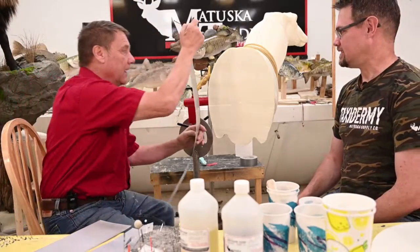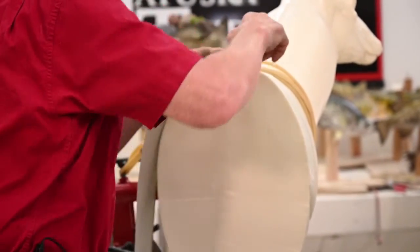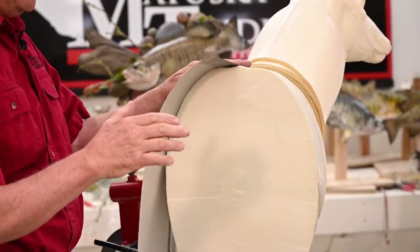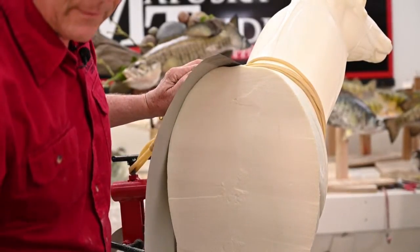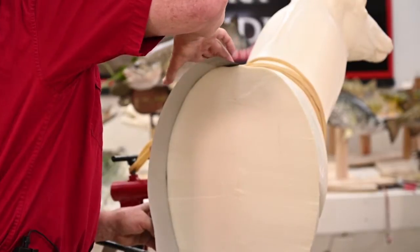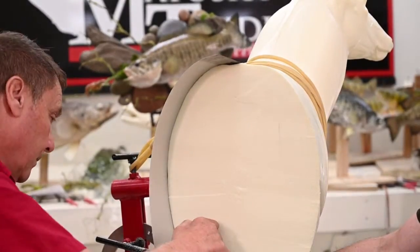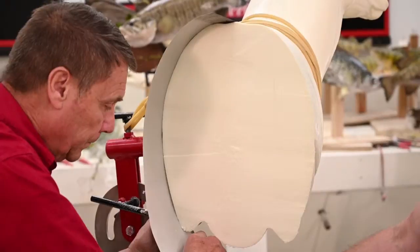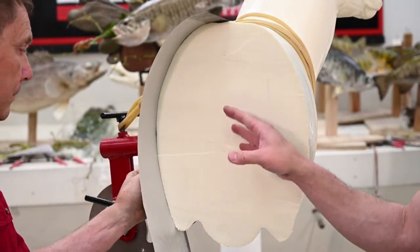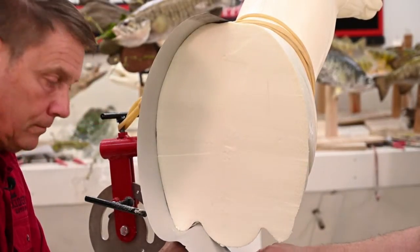And now we're just going to pin this in place. Now, if we put a quarter inch of foam into here, it's going to be probably plenty. I'm actually leaving a lot more stick out here than I really need. And you'll want to make this dam fairly tight, but you don't have to make it airtight all the way around. As long as you pour your foam into the center and let it rise to the edge. If you pour it along the edge, of course it will escape. I gotta chase it down.